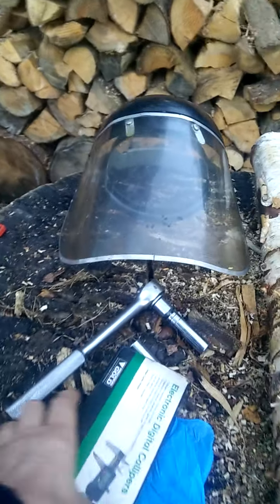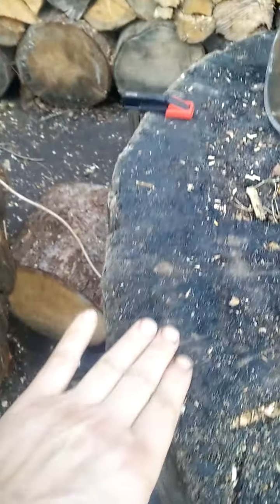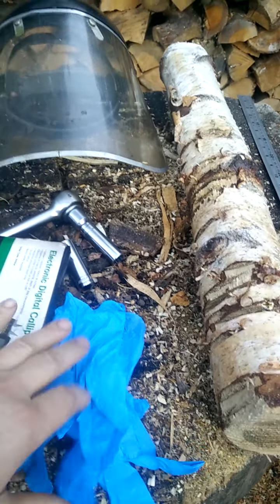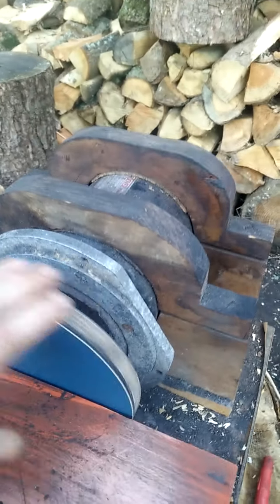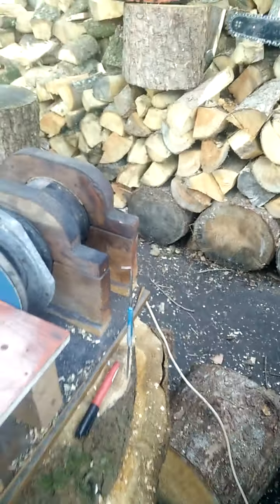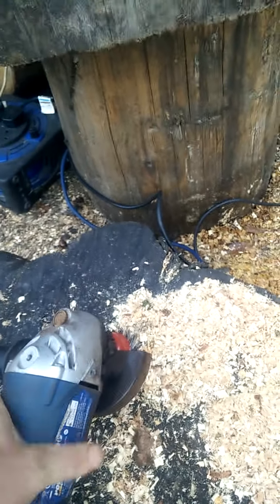I have a couple of essential things when I'm dressing the guide bar. A caliper - really, really useful. It can be done without it but it's really useful to have. Also a couple of clamps. Essential as well - if you're using petrochemical products, particularly old oils when cleaning things up, don't take any chances dermatologically with your hands and skin - just always wear gloves. And this is my perpendicular circular facing wheel which I've got different types of grinding papers on. I've converted it to a velcro pad with a bar that lets me alter angles - that's for dressing the guide rails. Also a pick, permanent marking pen, and a twisted knot grinder for rapid material removal off the face of the guide bars.